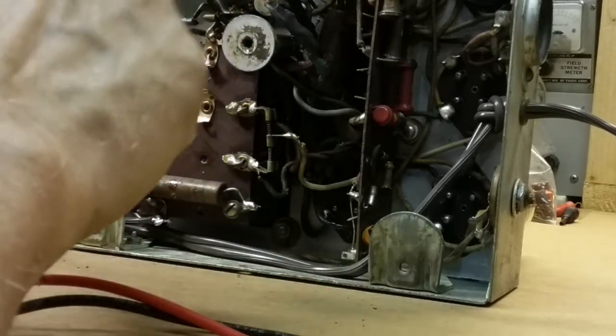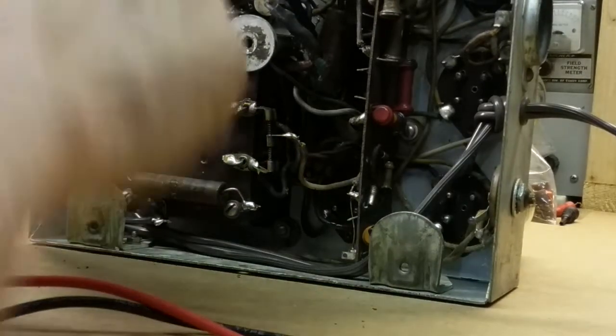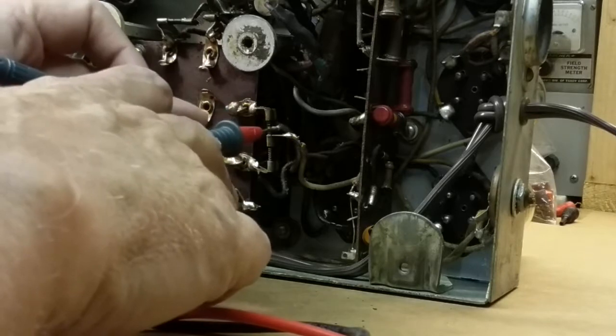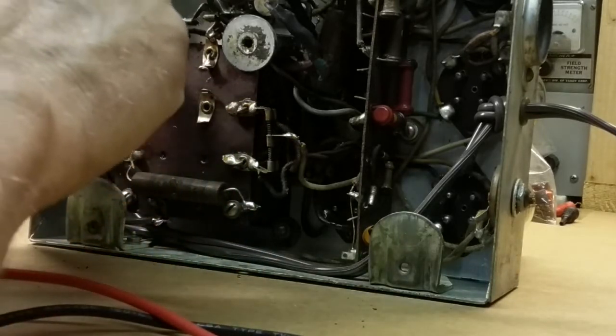That's okay. If we have to replace it, we'll try to find a replacement of the same value with the same wire round rating. Not the easiest thing to do. But we can tell if that piece of coil is connected the same way we checked the coils here with the center tap approach. So let's start with the side we know is most likely good.